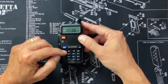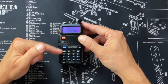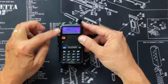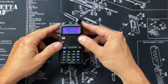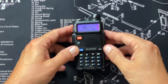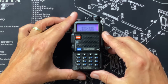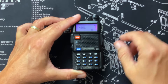To get to the squelch, we go into the menu. I can scroll up and down using the arrow key to different menu options. The squelch menu is the default — the first one that comes up — so it's already selected. I'll hit menu again, and that lets me change the value on the lower line using the up and down arrow key. I'll set it at 5 and hit menu again, and now it's saved. If I use the exit key to go out of the menu, I can see that squelch is set at 5, right in the middle. Make sure squelch is not set to 0 or 9.